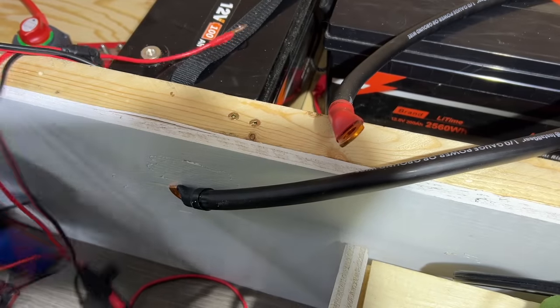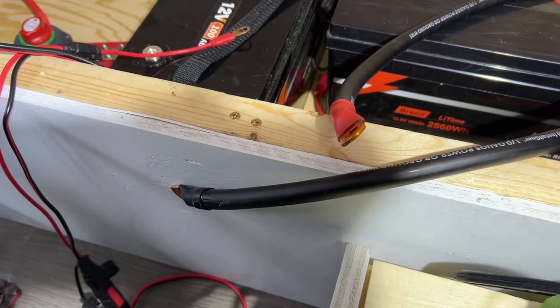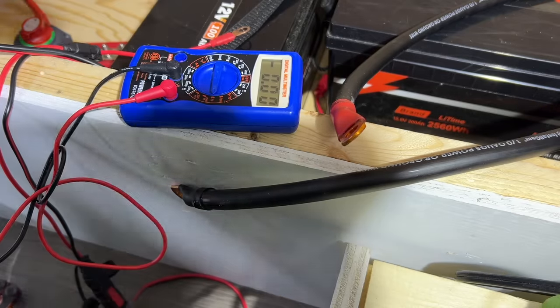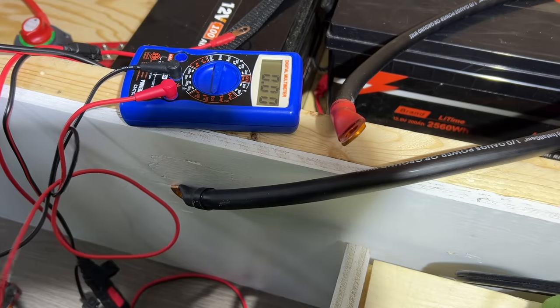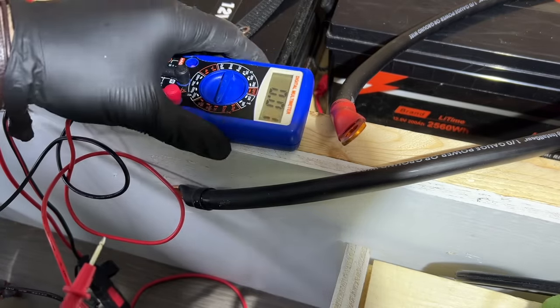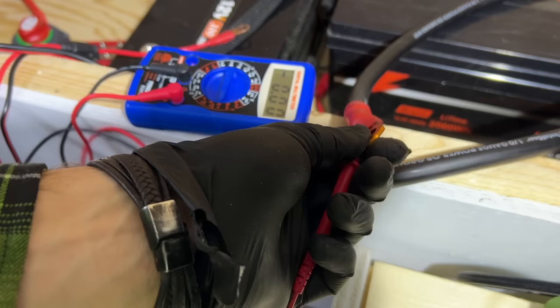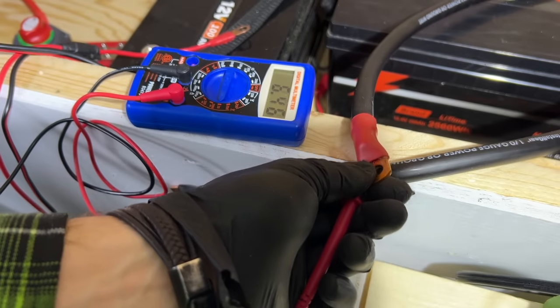So both batteries are completely charged up. We're gonna disconnect those chargers and pucker up. Got our wires here, negative and positive, connected to negative and positive on the battery. Now, just to make sure, take our multimeter here, put it there, then we're going to touch the ends to the ends of the wires, and if we get a reading of around 14 volts here, we're good to go. So, positive and negative.